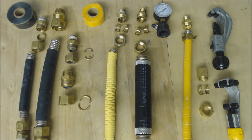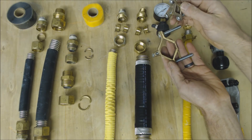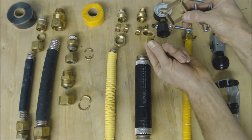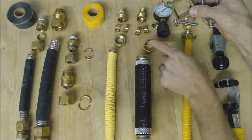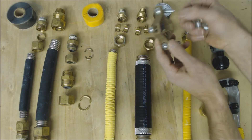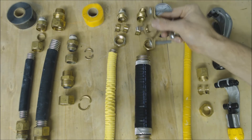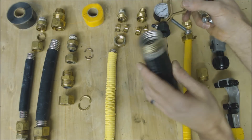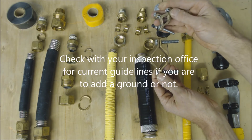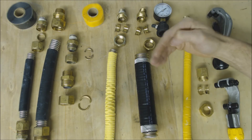These black outer coatings give a better rating for potential lightning strikes, but you need to check your area to see if you need to ground your gas line as well. Grounding is typically done with a 6-gauge solid copper wire, clamped around your schedule 40 piping or the brass connections — definitely not on the corrugated stainless steel tubing itself; it's on the fitting or schedule 40. Grounding requirements have changed a lot over the years, so go by what the trainer says for that particular manufacturer.